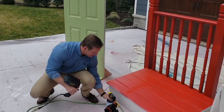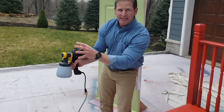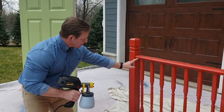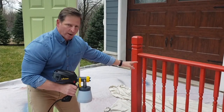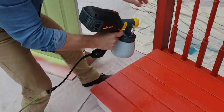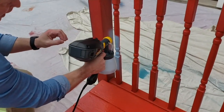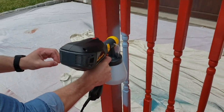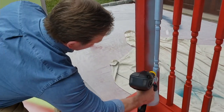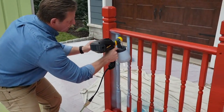Using the lock-and-go system, switching to the detail nozzle is that easy. The nice thing about the detail nozzle is when you get to something like a spindle where it's precision work — you don't want to do that with a paintbrush. Set it to high for a lot of paint. Look at that — the paint goes right exactly where I want it. Pinpoint accuracy. This is the detail part of the detail nozzle: very little overspray, and you can see how well it's covering, going exactly where I want it to go.